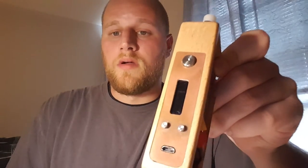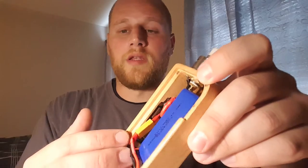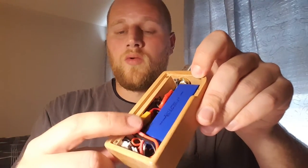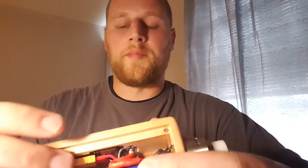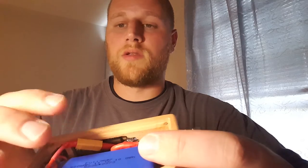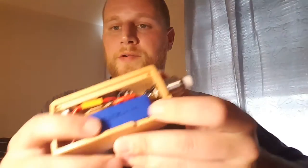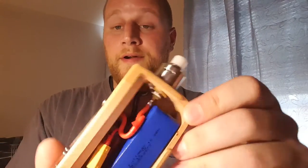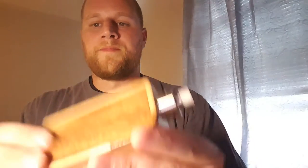The charge chip is all integrated with the board. Once you get the LiPo you just plug the tap in and solder on your connector — this one is an XT30 connector, a banana plug. They sell them all over the place. Make sure you use a connector, don't hard-wire it on there — makes it much easier. Double-sided taped it in, and we're up and running at 200 watts, although I'm only getting 100 with Kanthal right now, which is a bit strange.